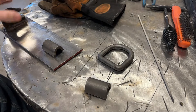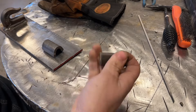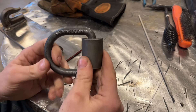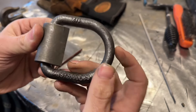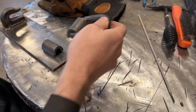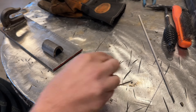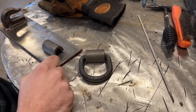Now let's talk about D-rings. These are weld-on D-rings - they also have bolt-on ones but we're focusing on welding these. They have a rating on them: this is the breaking strength at 12,000 pounds. The actual rated load is probably only like 2,000-3,000 pounds. These shouldn't really be used to support human weight, as the packaging states. These would be common to weld on a trailer for your tie-downs - very handy for that.